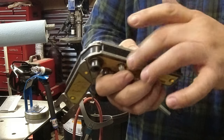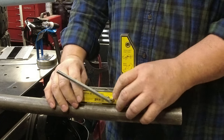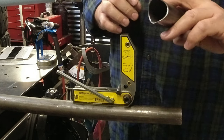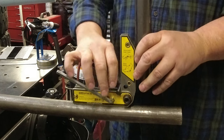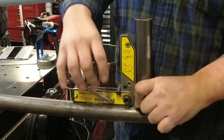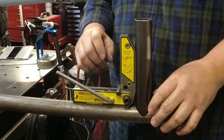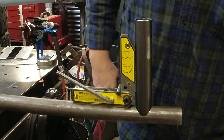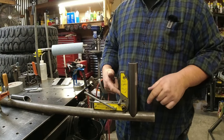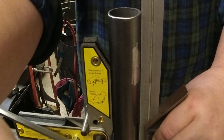With the recess of the magnet and these two rails, it works really well on tube as well. With tube or pipe it'll self-center on those rails, especially if you have pieces you're trying to put together. The version where you can turn the magnet on and off would definitely be a big help for fit-up. It'll hold everything in place while you get it all tacked together, and it holds it pretty square as well.